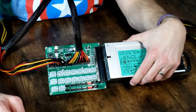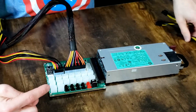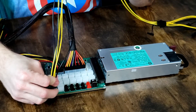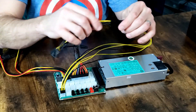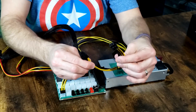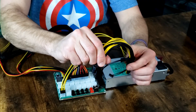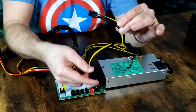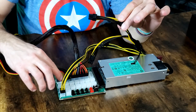The last and most important part is our GPUs and our risers — that is for all of the 16 PCIe 6-pin plugs. Take your standard 6-pin PCIe power cable, plug it in, and run it up to your GPU. Here I'm running an adapter to split a 6-pin into dual 8-pin. You can take both and run them to a single GPU if you need two 8-pins, or if your GPU only needs an 8-pin, use a single 8-pin to your GPU and a 6-pin to your riser — all powered with one PCIe cable. You have 16 of these.